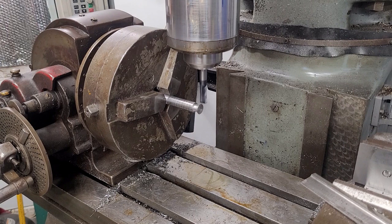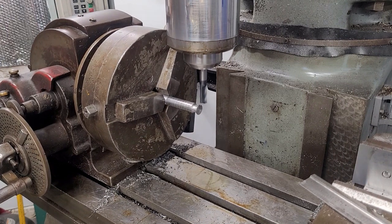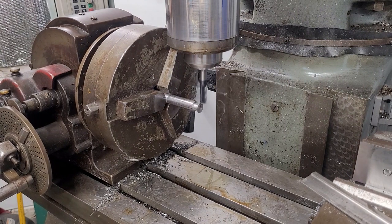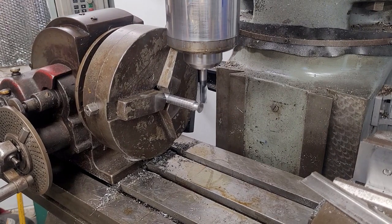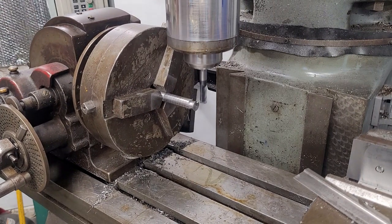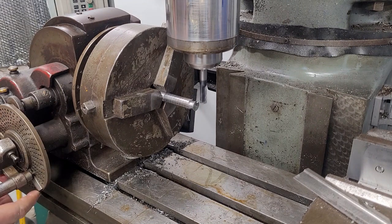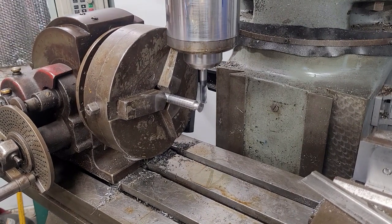It still held well enough to finish the job. I had a little more run out than I would like, so I was forced to take lighter cuts. You can see here I'm using a carbide end mill, with the tool itself being held in my dividing head. I wound up cutting this with four flutes — the original plan was two, but I think the web wasn't going to be quite strong enough.